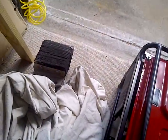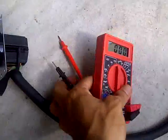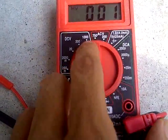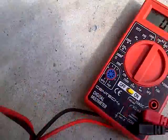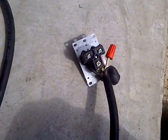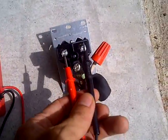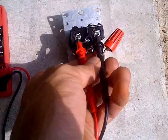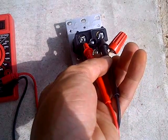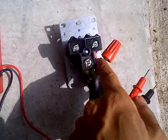So guess what I did? I got this free multimeter, and I turned it up. AC voltage, 750, 200. I always set it on the higher range so it doesn't fry up my free multimeter. Let me show you guys a little better. So basically, from that point on, I touched it here, and with the white wire being in there, I only got a reading of 125 volts. And I was like, well, that's not going to work. I must be doing something wrong. So I figured this might be another hot wire.